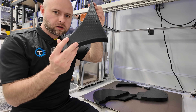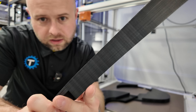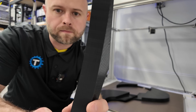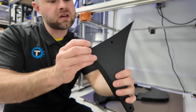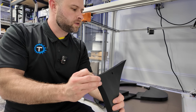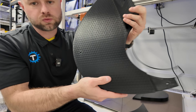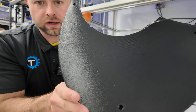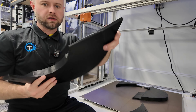Just some adhesion issues on the build plate — otherwise the parts look good. Let's look at this: it's a 0.4 layer height on a 0.6 nozzle, so layer lines look okay. There's a little something — one of these layers looks a little sus, and that might be from... I mean, it's well adhered, it's solid, the infill looks great. Taking a look at some of these bigger pieces, this is one layer down on top of the infill — you can see through it — looks pretty good to me. The layer that was against the plate is kind of beautiful, at least compared to all the other Giga prints.